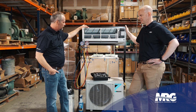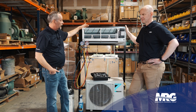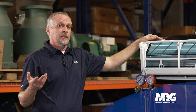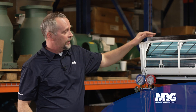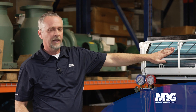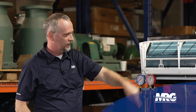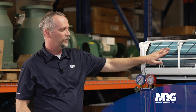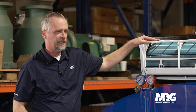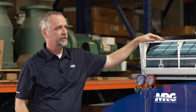Electronics is going to get you there. Once you get close, then you need to start spraying your solution on it to find exactly where the leak is. Then we've got to recover the gas out. This gets missed a lot of times — you've got a refrigerant leak leaking gas out into the atmosphere, you put your recovery machine on and start pulling that refrigerant out. But once you get below atmosphere, now you're pulling air in that's going into the refrigerant you just recovered. So if it's a big system with a lot of gas in it, maybe recover it down to five PSI and don't try to get any more in your tank because you're not going to be able to reuse it — it'll have non-condensibles in it. If it's a small system, just pull it all out and charge it with new gas.